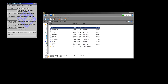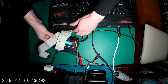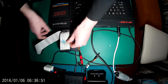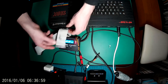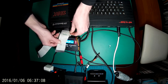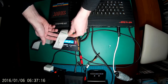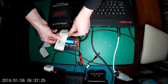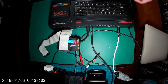So that's some advice from me. Anyway, let's get back to the video of the Spectrum itself. You'll see I've just got a 5-volt line in here, and over here I'm using a standard old-style floppy disk connector. The side that plugs into the Spectrum is the side that would have plugged into a five-and-a-quarter inch drive, and I've got the middle one plugged into the HXC. I was very lucky and got the cable for 300 yen — about two euros — from the secondhand shop near me. The only one I've found recently on Amazon is being sold for about 10,000 yen, which is around 80 pounds.